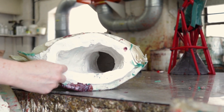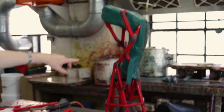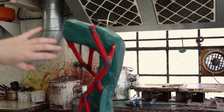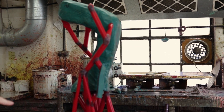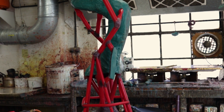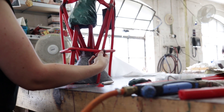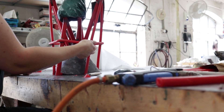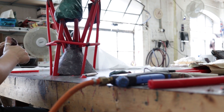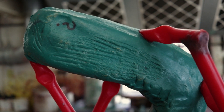That's something we take out in the wax once it's come out as a whole wax piece. So in here, we'll paint or pour a wax into it. This green wax is our high-quality wax — it picks up all of that detail. It's a lot thinner than the brown wax. Throughout the whole process, it's really important that we keep all of that detail — what Flanagan intended on his original piece, we are still maintaining throughout the process. All of the marks and lines are still in it.